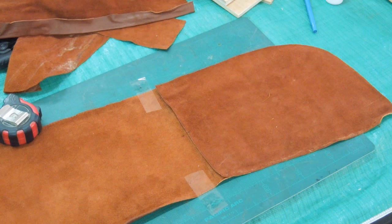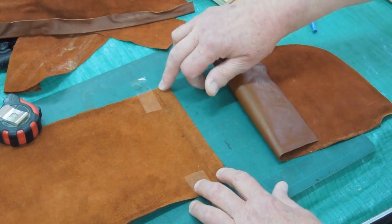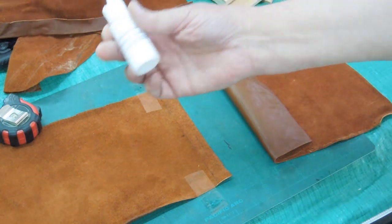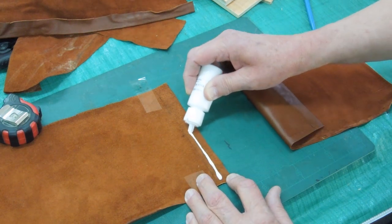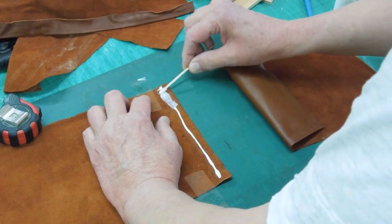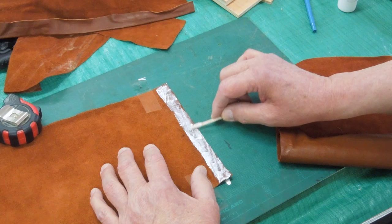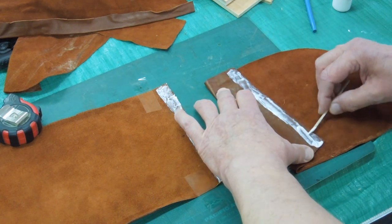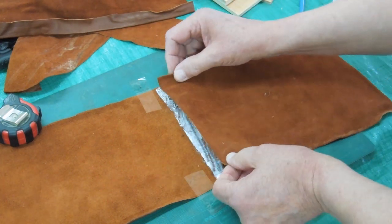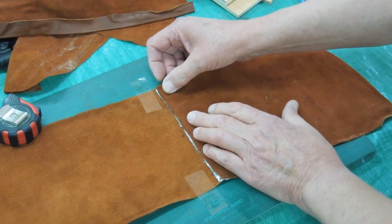I have some leather from an old leather jacket — one that was never worn, but the leather is fairly old, and none of the pieces in this jacket are long enough to make a bellows. I laid out a three-quarter inch strip on the rough side and on the smooth side. I'm going to use a felt and leather glue that's used by people that work on organs for a living. It takes quite a bit on this side, not as much on the smooth side. This will clean up with water while it's still wet; once it dries, it's supposed to remain flexible. I've got a piece of packing tape here and here just holding that leather a little bit taut — I don't want to stretch it but I don't want it curling up on me.